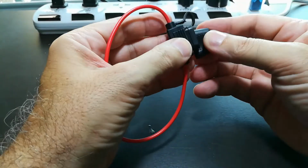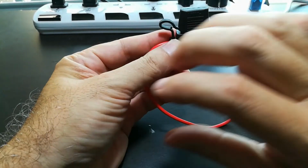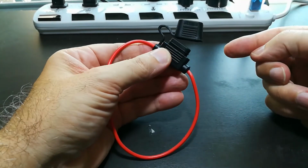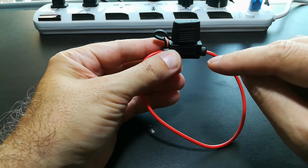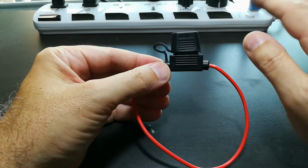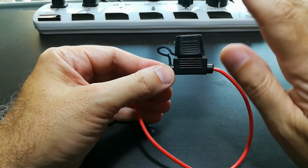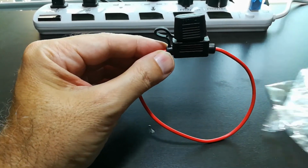And this will add an additional level of fusing for the entire 20 cell module, and this will give it additional module level fusing on top of the cell level fusing with the fuse wires. So if I ever do anything, I take the chance to over-engineer it, so that's what I'm doing. So there will be 20 of these, and here they are.